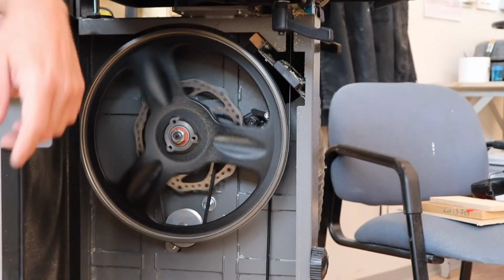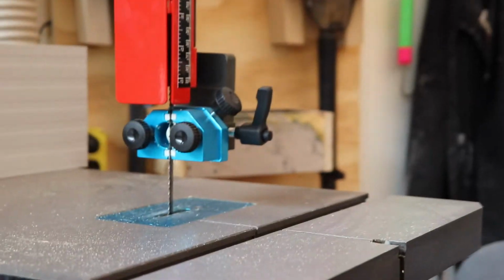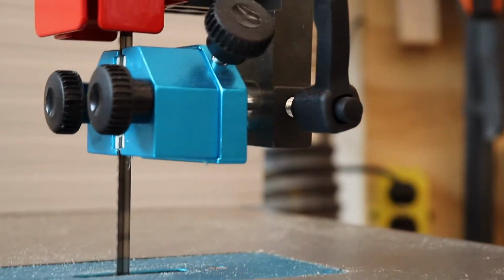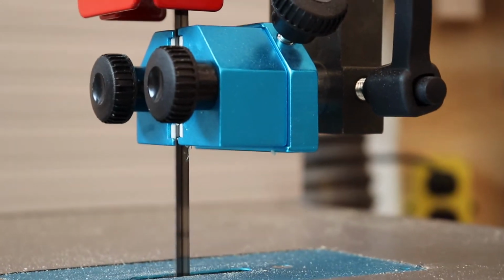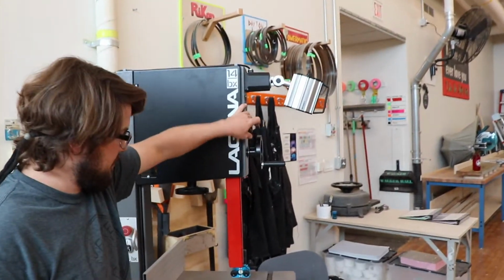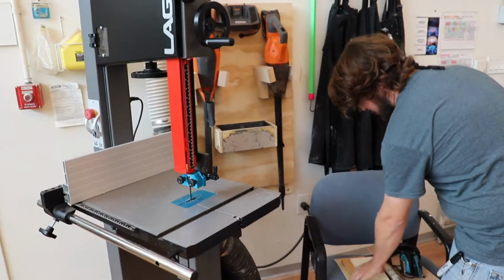This drives the blade. The blade is traveling down through the table, and this is actually one of the most forgiving saws to use in that it's not trying to eject the material away from the table. It's actually holding the material down as it travels through the table. You still need to make sure you have your hands securely on the material or push stick holding it down against the surface whenever you're working. When we're using the saw, we want to make sure that all the doors are shut, and we want to set our guard and guide appropriate for the thickness of the material we're cutting.